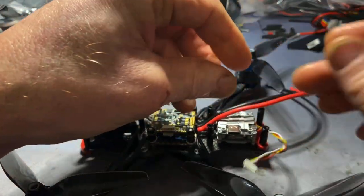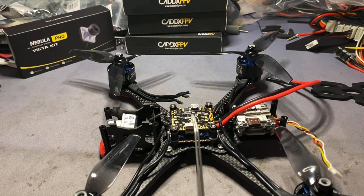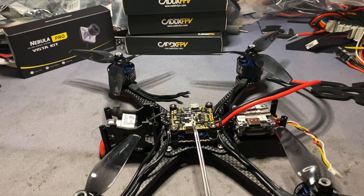For power supply, I've gone with the VTX header pin on top. This rail has ground, RGB LED driver, 5V, VBAT, and TX and RX1. The VBAT right next to it here has two little pickups for direct LiPo power. But the board is supplying VBAT power.